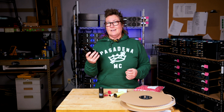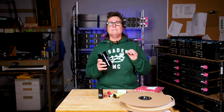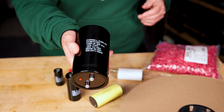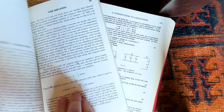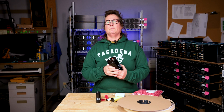Capacitors are kind of like batteries — they store energy. In power supplies, we use these in circuitry to make the DC power very smooth after we've rectified it from the AC power. These big banks of capacitors store energy in the form of joules. It's a long-held belief of ours that the more joules we have in our big power amplifiers, the more instant impact we can have in the sound. It contributes to the strength of the power amplifier.